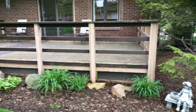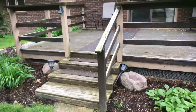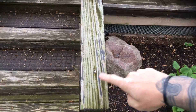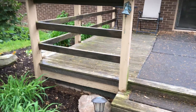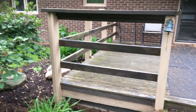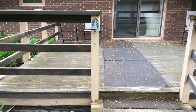This would be the deck — a separate price. It would be redoing the deck: the floor, the rails, the steps. As you can see, there's some issue with paint adhering. We talked about using the Peel Bond Primer on all the horizontal surfaces, all the rails, and the floor itself. It is a semi-transparent stain — you can see it on the rails there. On this column, that's the color it would be. It should cover pretty easily and pretty well. You've also got your corners, which are more of a solid stain.